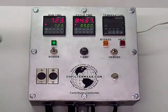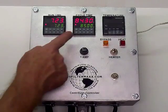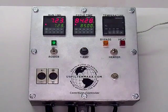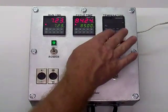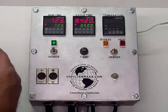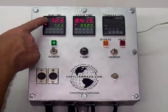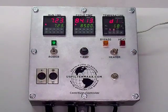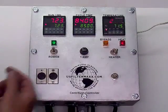This is a single-shot mode: when it reaches the end of 7.23 hours, the whole unit shuts down — same as on the standard controller. This is our cycle time to dump, in minutes. At the end of 85 minutes the centrifuge will shut down, the heater will shut down, the centrifuge will dump the sludge for four minutes, and then it'll start back up. This is a perpetually cycling unit as long as the runtime is set.